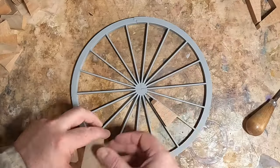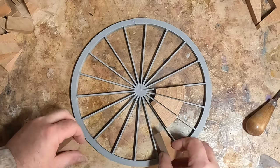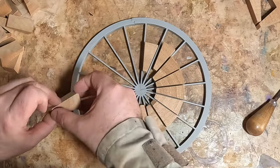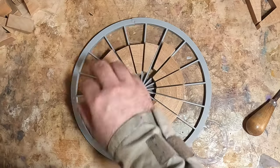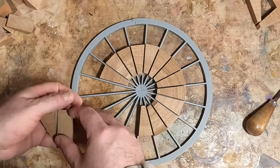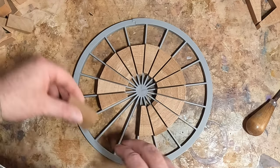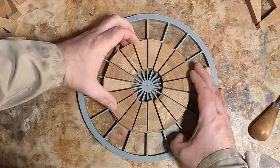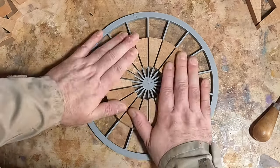Speaking of the base, that's next. For this I needed three segmented rings with resin joints. I used a 3D printed template to hold the 18 segments, and an elastic band stopped them moving around. Then I used another 3D printed part — this is super glued in place to maintain the two millimeter joints after the gray template is removed.